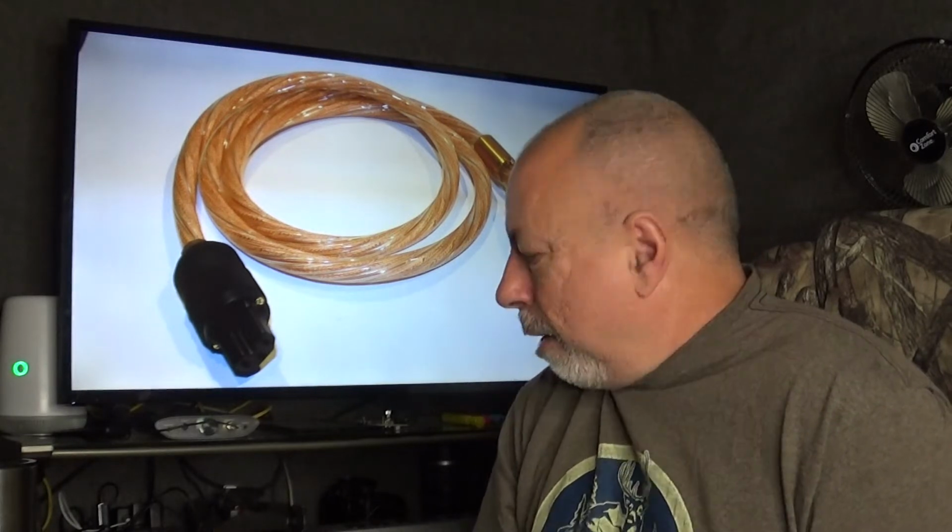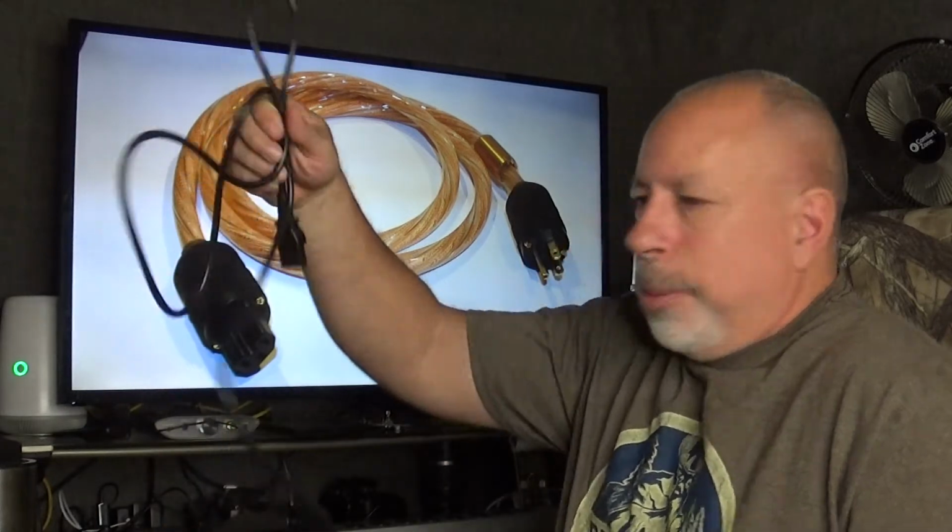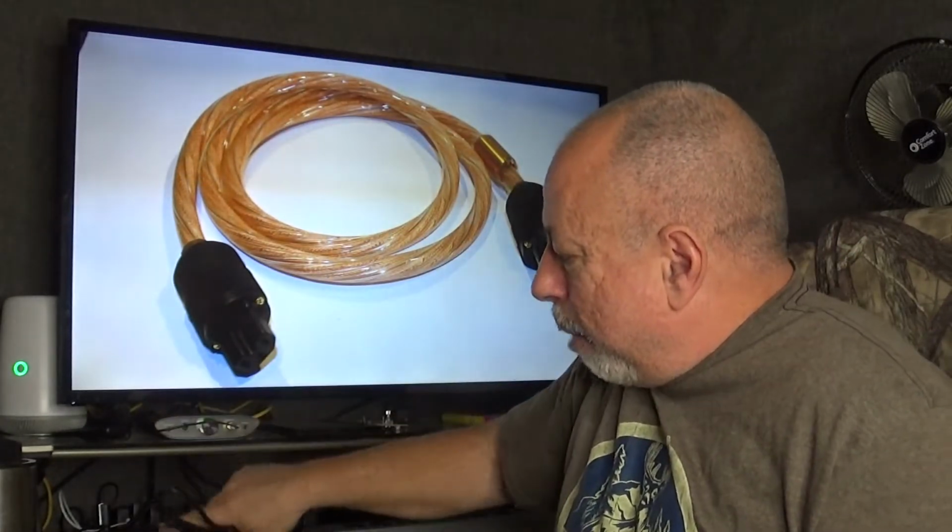So what I did is I paused my CD player and I put the amp to high gain, and I listened, and first I did it with the stock cable, which would be like this. I turned the volume up on the amp, and like I said, the CD player was paused, and I did this with two different DACs to make sure the noise wasn't coming from the DAC. One DAC was the Audio GD R8, R2R DAC, and the other was the Topping D70S DAC. So I repeated this experiment with two different DACs.